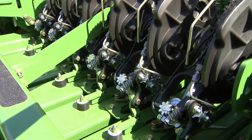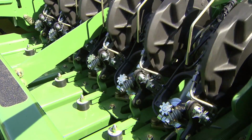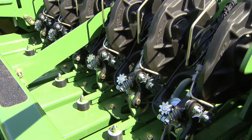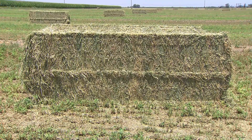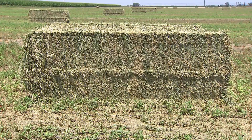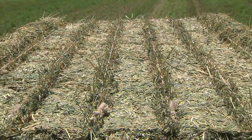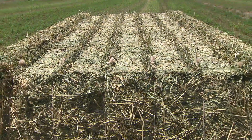The first knot terminates the current baling cycle, whereas the second knot marks the beginning of the next cycle. As a result, using two threads, the system ties 4 knots per bale, 2 at the front and 2 at the end of each bale. This is the visible trademark of the KRONE double knotter technology.